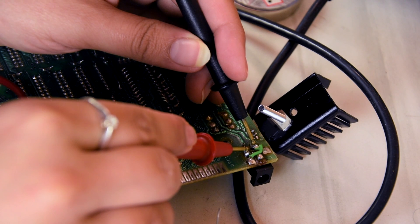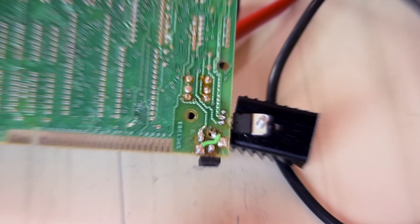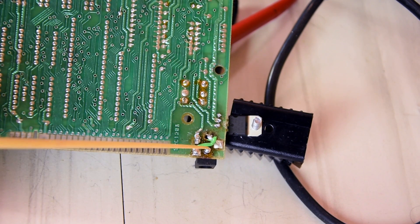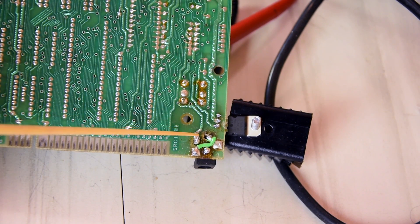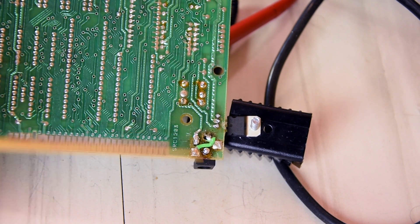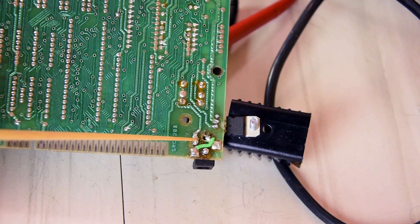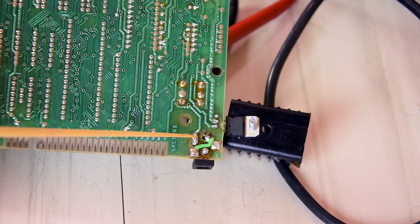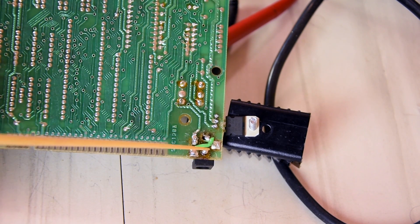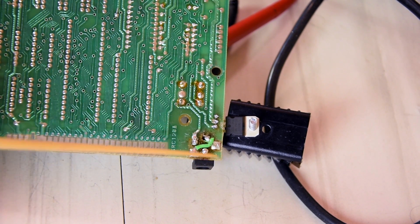Okay, let's test with these two. It did not power up, because I did a slight bit of a boo-boo - I connected the positive to the switch instead of the actual terminal. So this actually connects to the sleeve, however when you plug the thing in, this disconnects and that ends up being positive. So basically I need to connect this to that without being connected to this pin, so I'm gonna need another wire.